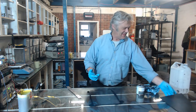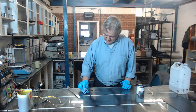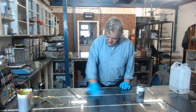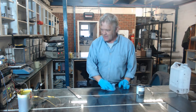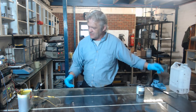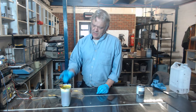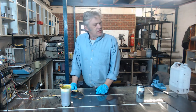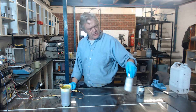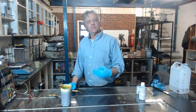That is really quite awesome all by itself — but so what? Well, you could use that as EM shielding; you can apply it to plastic cases so those cases could be EM shielded. But you can also electroplate it once you get a conductive surface on it. The electroplating solution we're using is our universal electroplating solution — this stuff.